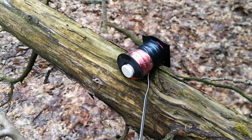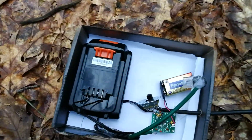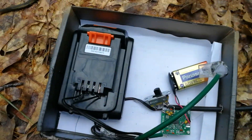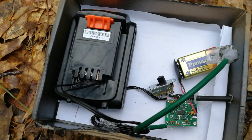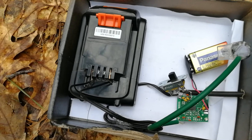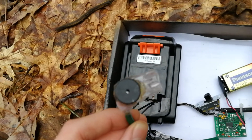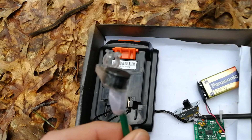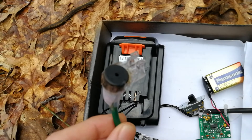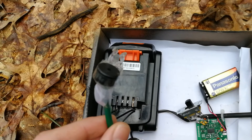The coil is hooked up to a big cable which comes all the way over here to my setup, which is an electric drill battery, a very sensitive amplifier, and a switch, which allows me to polarize and depolarize the coil. I'm listening to the output signals on this piezo transducer, because it's very nearly perfectly tuned to the signal I'm after, which is 2.28 kHz where I'm located.